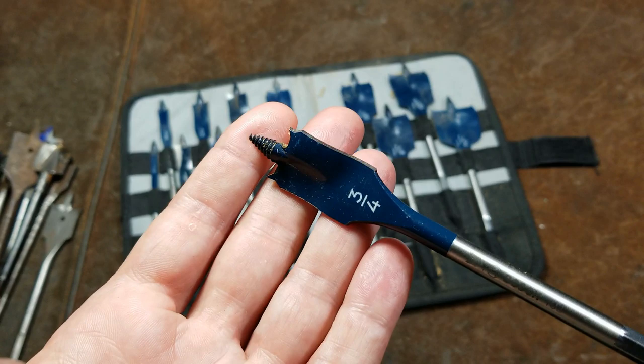These Bosch Daredevils are actually an evolution of the much earlier Bosch bits — we can see the Bosch branding right there. The earlier ones had an interesting stamped thread, more of a flat bit with two scoops. This newer version is certainly improved with quite a bit better geometry. They have two spikes and an additional bevel, so it makes the cut more progressive and the walls a bit smoother.